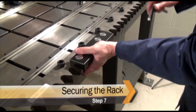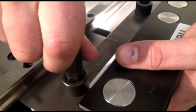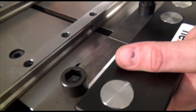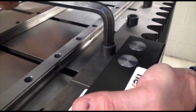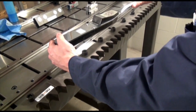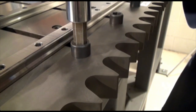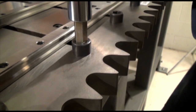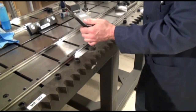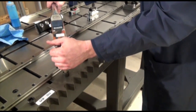To help ensure the rack is seated against the shoulder, force the alignment tool into the rack while tightening down the remaining screws. Starting from the end of the rack on which the joint was first established and working toward the opposite end, tighten the screws with 50% of the RPS specified torque, then repeat with 100% torque.